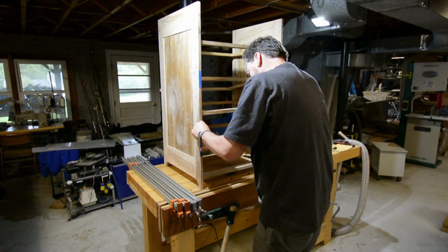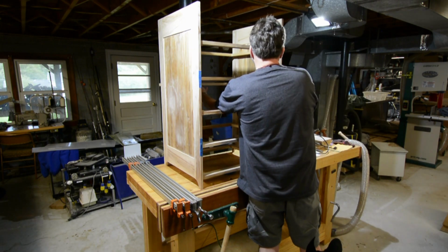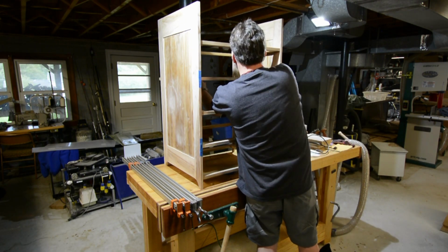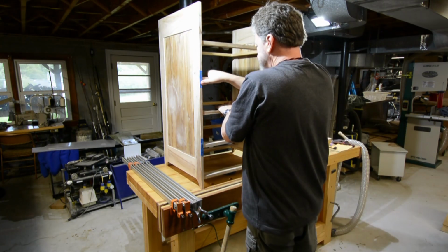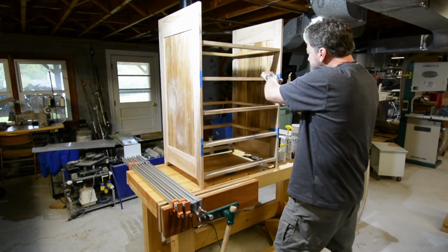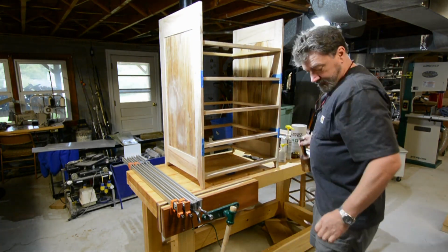The last two drawer webs go in simultaneously, very similar to the last. Mix up the epoxy, coat the joints, and slide them in from the back so that the front stopped rabbet or dado allows the drawer web simply to go in and seat.